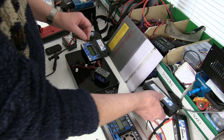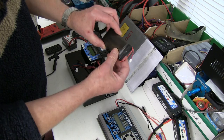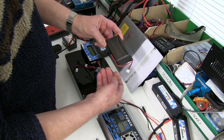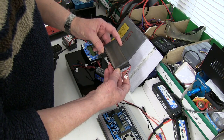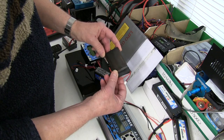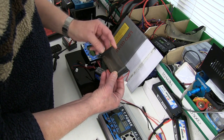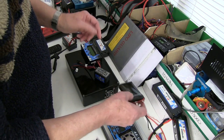Is it safe if they're swelling up? Well, the sacks they're in are very tough. Underneath this black heat shrink there's another sack that seals them in, which is a very tough type of plastic the manufacturers have made. That can swell up to a really large size without bursting, and it also has the ability to reseal itself if it gets a small cut. Generally, once it's lost performance, you might as well dispose of it rather than risk it swelling up even more.